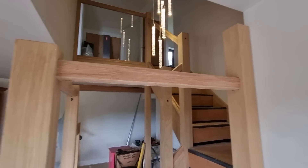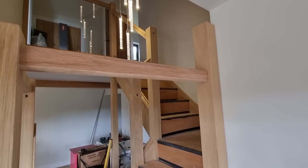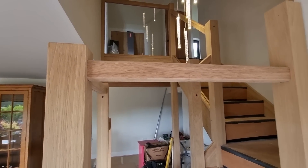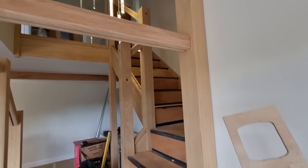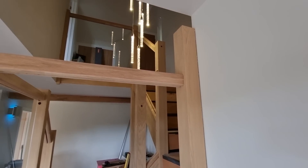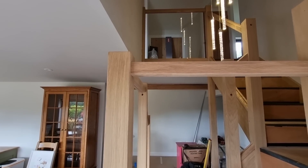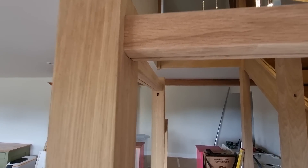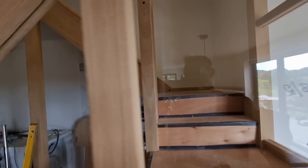That gives us just enough to take off with a template cutter in the router. We made one relief 15 millimetres deep and the other one 7 millimetres deep, then cut the handrail — it's a matter of pushing it in one side like the glass and pulling it back, meaning no mechanical fixing is needed. I made the template with the router and cut it out with a combination of a small coping saw and freehand routing. Once you've done that template once, you can just go around routing all the others — a very straightforward job.